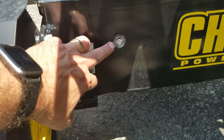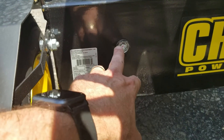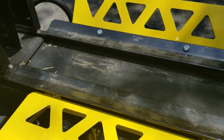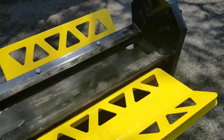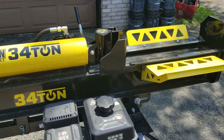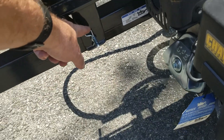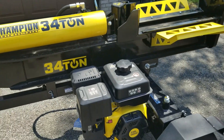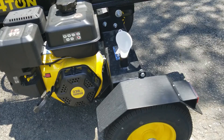Right here is the oil level showing how much oil is in it, so it's going to be filled about half full — right about in this area. This all came assembled. This holds the logs and the ram slides it to the end. This one does vertical or horizontal — right now it's in horizontal mode. You pull this pin and you're able to lift it up into the vertical position.